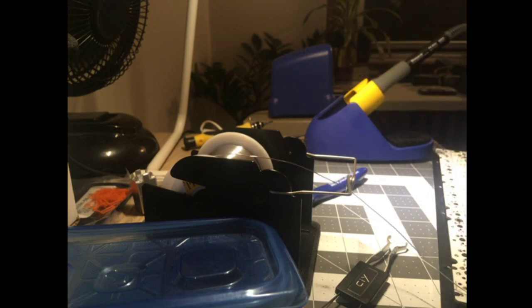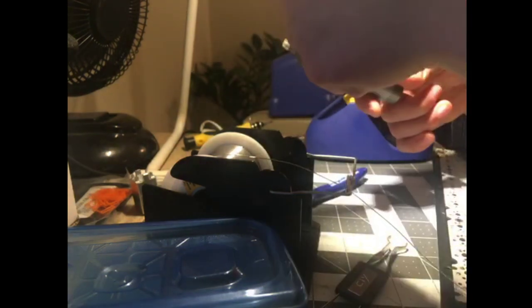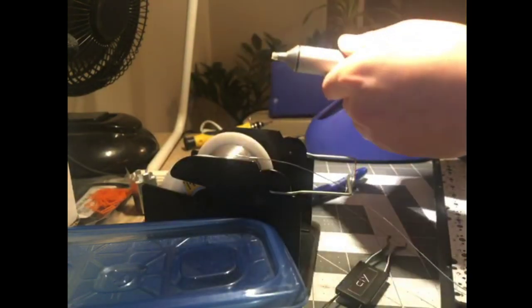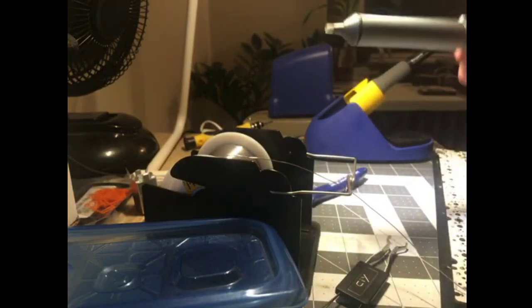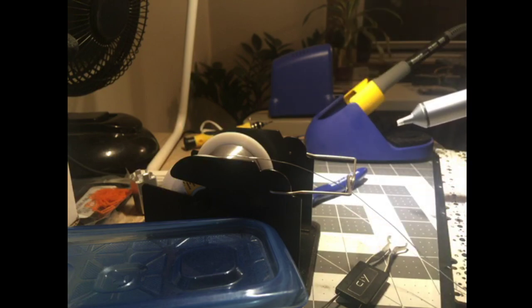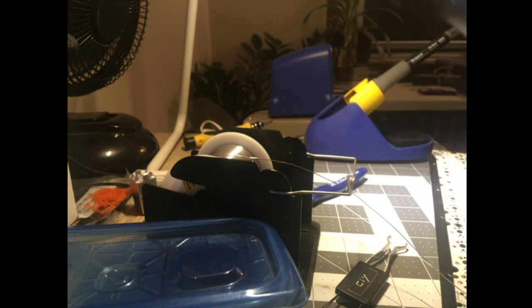For context, for anyone who doesn't know what I'm talking about, this is the Engineer SS-02 solder sucker. Mine's actually clogged right now completely. I have to drill out the tube because there is solder caked inside there from a really egregious build that also broke my electric solder sucker, the vacuum, and I had to order a replacement handle. Literally put me out $50 by somebody using cheap solder, me being too stupid to add extra flux. Add extra flux when you're desoldering a whole keyboard. Or add fresh solder like Rumai said, but just add flux anyway. The $2 one's not as nice as the genuine one.